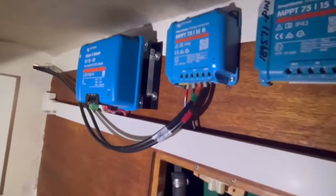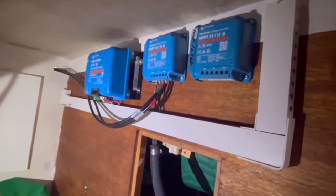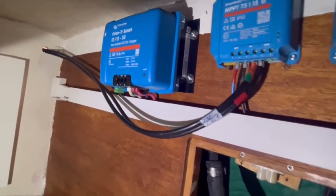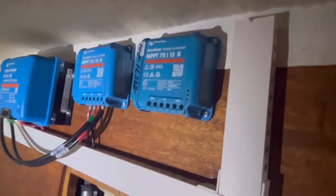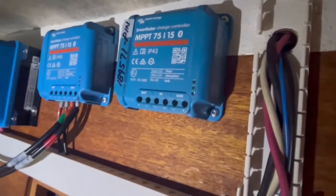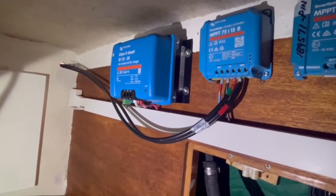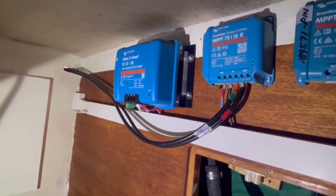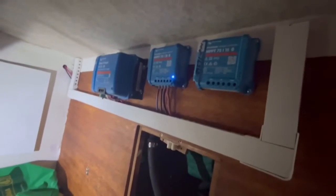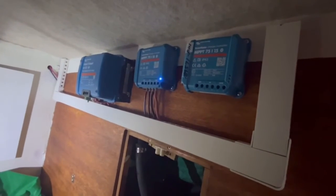Next I want to get rid of the free-hanging wires now that the wireway is set up with covers on it. The Orion DC-to-DC charger has its wires that go down into there and come up into the firewall behind this cover, into the engine room where the power is. The free-hanging wires go to my solar panel out in the cockpit — I'm going to disconnect those, re-splice them, and run new ones inside the wireway.